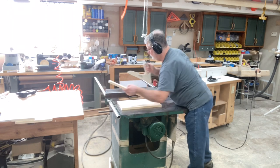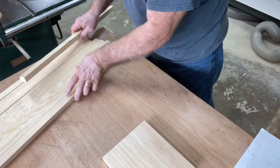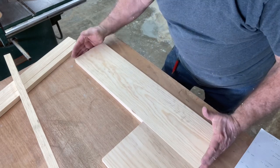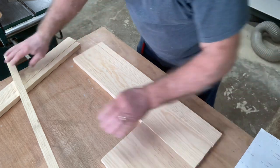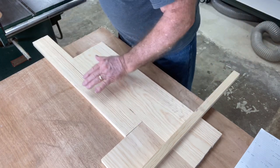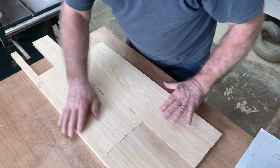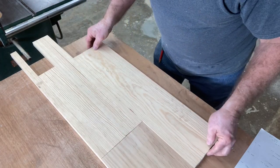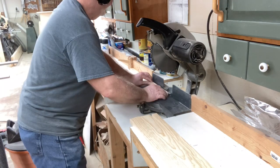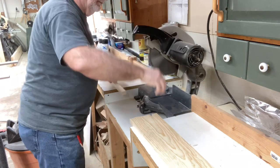I've done a video on making this flag, and I'll put a link in the description below to reference exactly how I made it. With all the stripes cut, I'm going to lay them out, make sure they all look good, and place them where I want them. You'll notice some are a little bit long — I cut all of them at one time out of the same stock material. Now I'm going to take them over to the miter saw to get them exactly cut to length. It's coming together — it's starting to look like a flag. At the miter saw, I set my fence stop at 24 and a half inches so I can cut all six stripes exactly the same length without measuring each time.